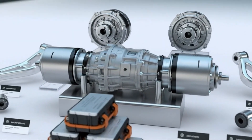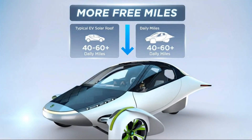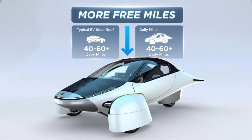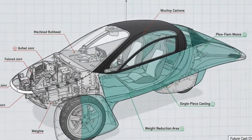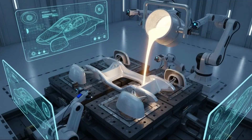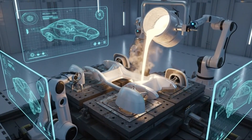Instead of having the stator wrapped around the rotor, the stator is placed between the magnets, almost like it's being sandwiched. The magnetic flux doesn't travel outward — it travels along the same plane as the motor's axis. This shift in design changes how the entire motor behaves, and when you remove the yoke, in what's called a yokeless axial flux motor, the weight drops significantly, allowing the motor to become lighter, more compact, and even more efficient.